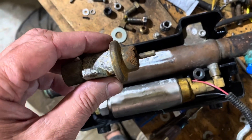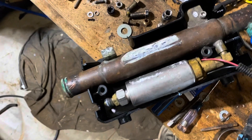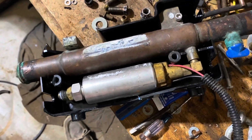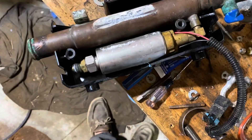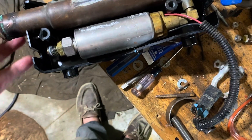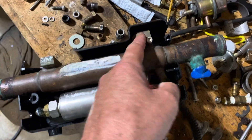There's a spring pushing a rubber diaphragm. When you put vacuum on this regulator, it compresses the spring a little bit and decreases the pressure. When the engine is at full throttle, the vacuum goes away and it increases the pressure. This is called vacuum reference fuel pressure. The regulator maintains a fixed supply of fuel pressure to run your injectors.